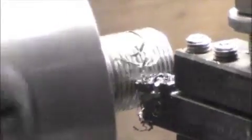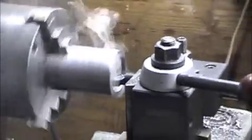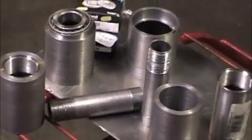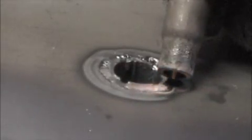You've got to make a few machine parts. Here we're making some national fine threads — one-inch national fine threads on one-inch pipe. All this pipe is easily accessible; this is one inch by 120 thousandths. Then you've got to part some — this is two and a quarter inch by 250 thousandths. Then you've got to bore it out in order to accept a race. You get a piece of 11-gauge steel, drill a one-inch hole in it, make sure you get it nice and square, tack it on, then flip it over and weld the one-inch onto it from the back side.